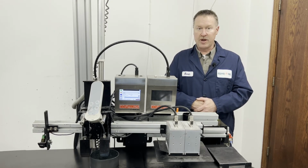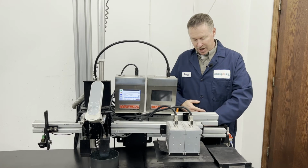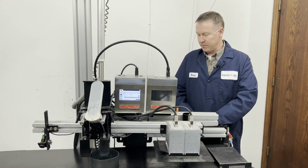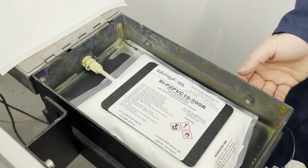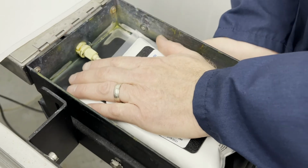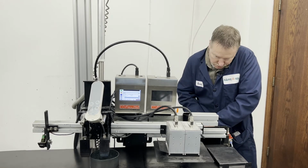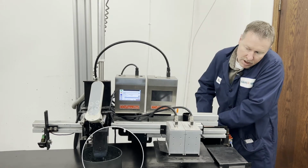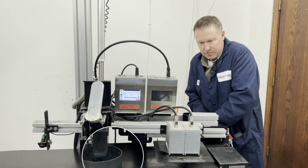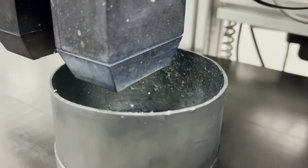We want to prime the bag. We want to prime the printer from the bag. To do this, you want to apply pressure to the top of the bag. That's what this plate is. It's a pressure plate, to distribute that pressure more evenly across the bag. You might want to hold underneath the whole pan system, depending on how much leverage you want or need, and you push it down, creating some pressure. And watch your head until you get some white ink, or whatever color you're printing at that time, come through the print head, which I see we've got right now.